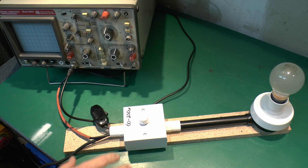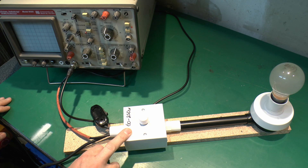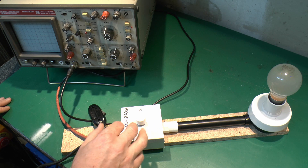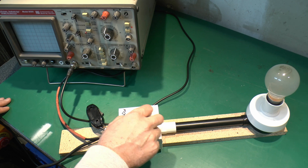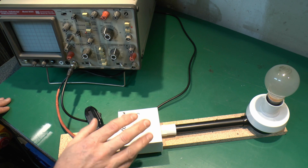Hello, I'm JW. This time we're going to have a look at dimmers again — we're going to see how these things actually work, and what they actually do when you turn the knob and the brightness is reduced. So we've got a dimmer here, just a normal cheap thing that goes from 60 to 250 watts, normally designed for incandescent lamps. We've got a lamp over here, a filament type, 60 watts, so that's obviously within the range of the dimmer. This switch here is basically to bypass the dimmer, so we can have the lamp on permanently without using the dimmer at all.